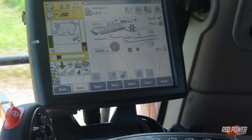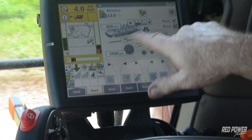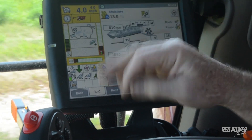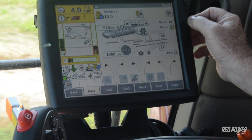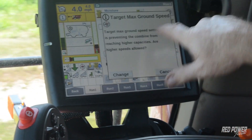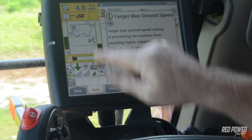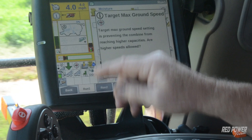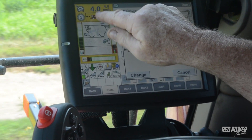Running along with feed rate on and in automatic crop settings, we reach up and hit the automation headliner switch. Without a loaded machine it's not totally sure what it wants to do, because automation really bases its settings off of what it sees from loss sensors and the grain camera. An empty machine is at a disadvantage. But you can see it switches to an A. Here it will tell you if you click on that little icon — if we're not up to our speed it'll tell you why — basically saying the engine load or ground drive load is different and not allowing higher speed. In this case it's just saying you wanted 4, you got 4 — nothing to complain about.